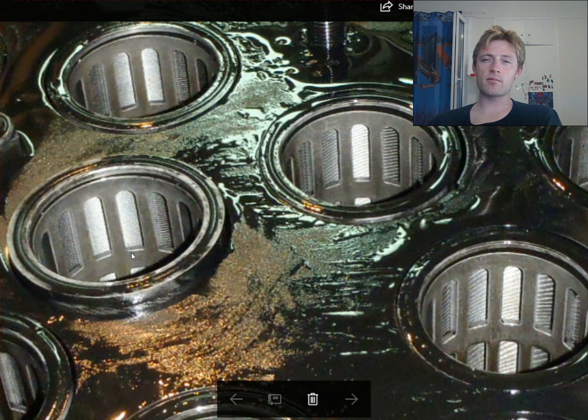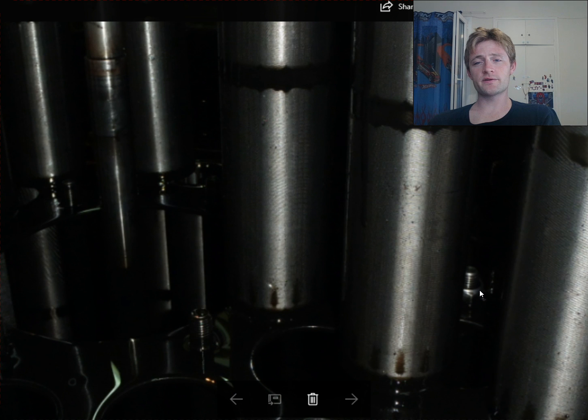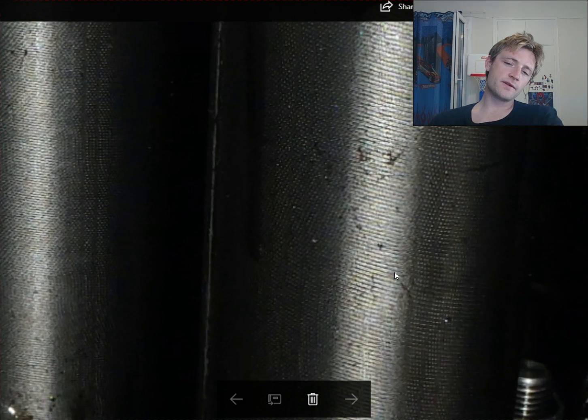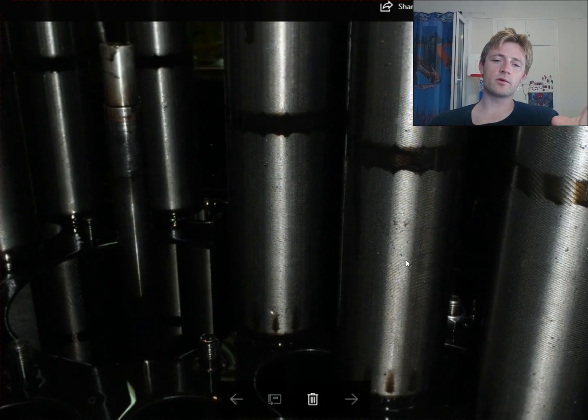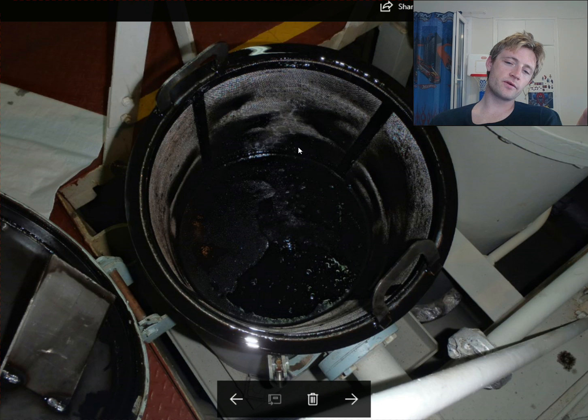These kinds of filters have some micron rating — the oil will pass and the dirt will be kept inside, it will be trapped. After removal, these are the dirty filters; you can see some dirt here. This type of dirt may be more than a few microns so it will not pass through. After removing all the filters, clean also the slash filter located here in the main filters below — that is also dirty; the most dirty part is the underside.